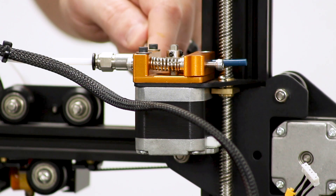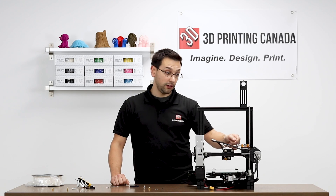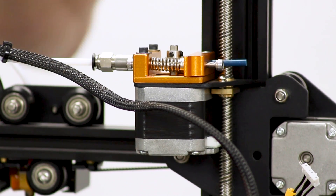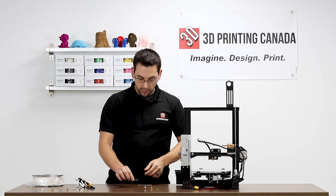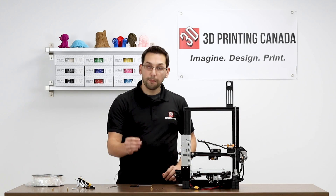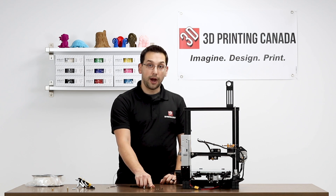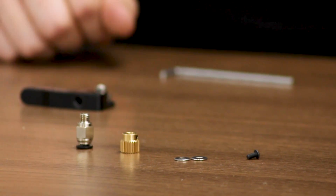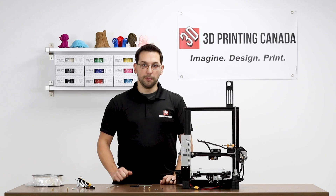There's also a note in the manual that says if you're going to tighten this coupler, be careful and tighten it gently, because this little tube is pretty thin-walled by design — you really don't need a lot of tension, just enough that it's snug. So with all that said, we have a couple of spare pieces: an extra coupler for PTFE tube, the brass gear which is exactly the same as the stock gear, two washers, and a little M3 screw. Don't be alarmed — just keep those aside in your spare parts bin.